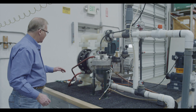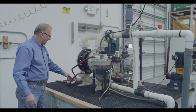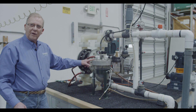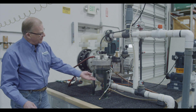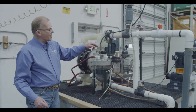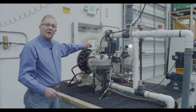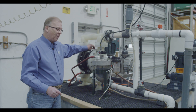I've set up a hose water line so that it will flow water into the pump's air exhaust and into the Spill Stop to simulate a diaphragm failure. When I put the water in, the Spill Stop will fill with liquid. The air will shift — the compressed air will shift the three-way valve and close the normally closed valve on the compressed air to the pump, which will turn the pump off.